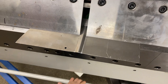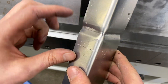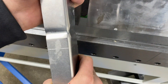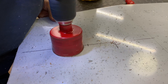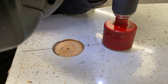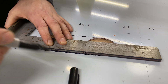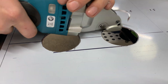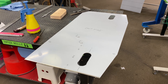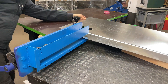Not bad. On the thicker material it doesn't form that crease - I'd say this is pretty much perfect. I was totally rushing the first one; I was just excited to do this project and didn't plan ahead. So this time I'm cutting the hand holes right now before I bend anything - it's much easier and I can mark everything while lying flat on the table. You can of course also use a jigsaw for this. This time the protective film is also on the right side, where it actually protects the shiny surface I want on the outside later.